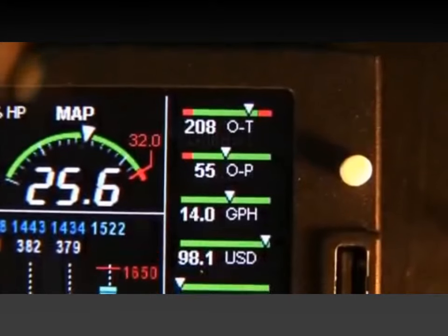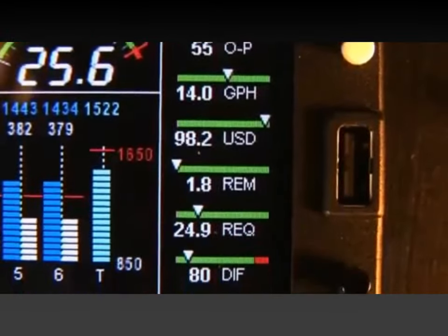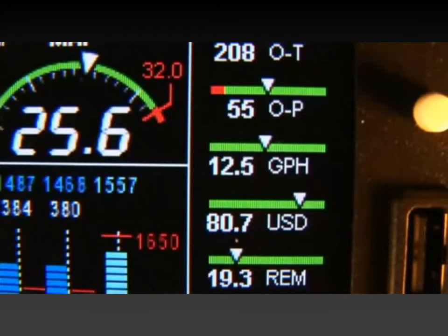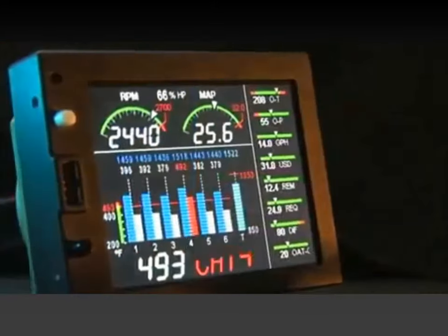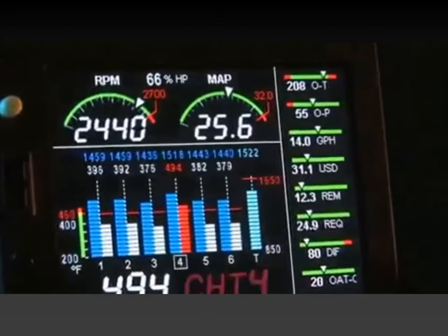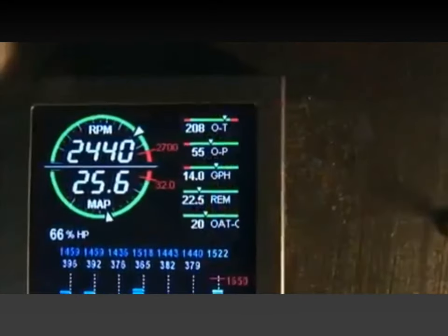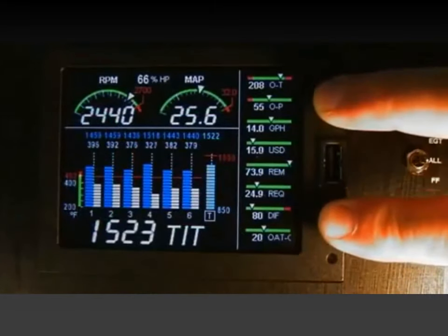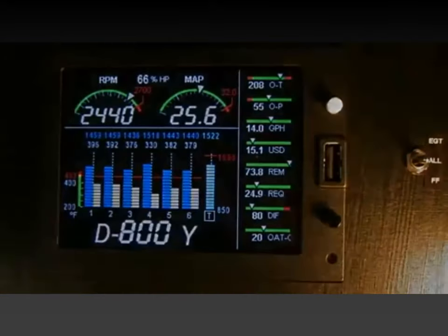The linear gauges provide both digital and analog indications for various parameters. The sliding pointer and color range marks give you a quick indication of where you are relative to the operating limits, while the digital values provide precise information. Since the EDM 730-830 series features the ability to be mounted in either landscape or portrait orientation, the display layouts will differ. You can also customize the gauge positions, which we will discuss in the pilot programming chapter.